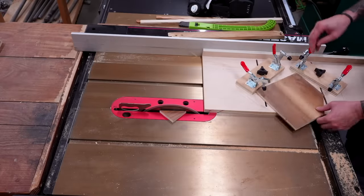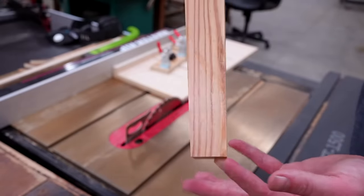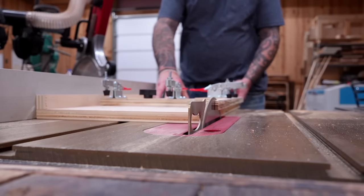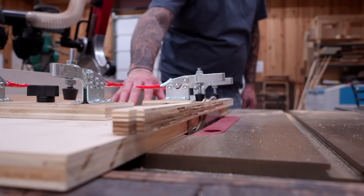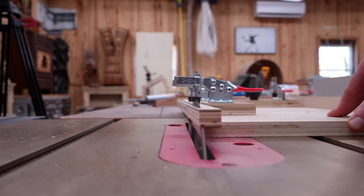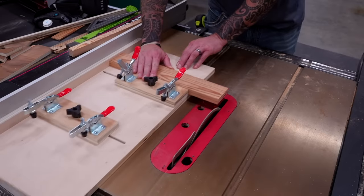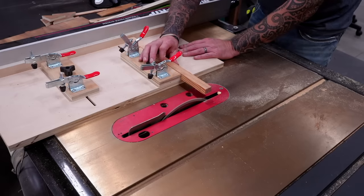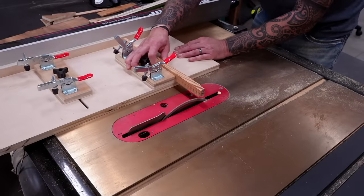You can set this up to make some pretty awesome shapes that would be hard to make on anything else, or even cut a four-sided tapered leg. It works as a crosscut sled for cleaning up jagged edges or making multiple cuts, or making those super thin cuts you don't want to run against your fence because of kickback. If you want to cut half laps or notches you can do one blade thickness at a time or put on a dado stack. And if you don't have an accurate miter gauge you can even cut tenons using this jig.